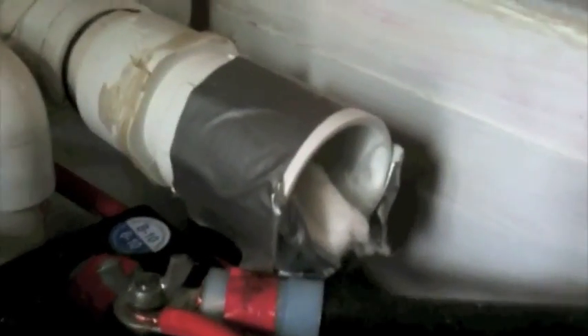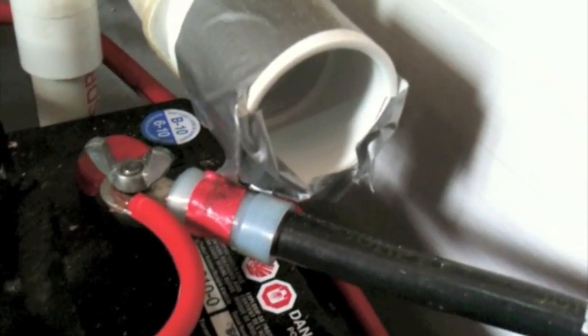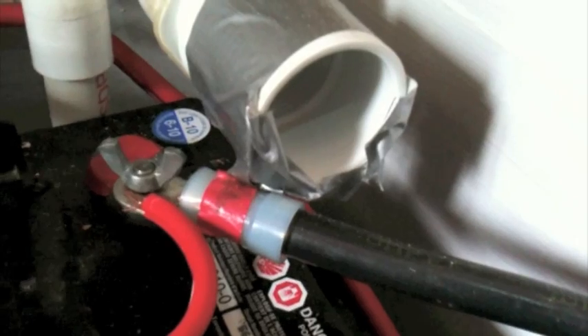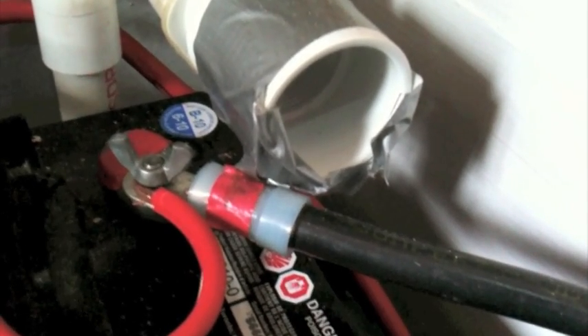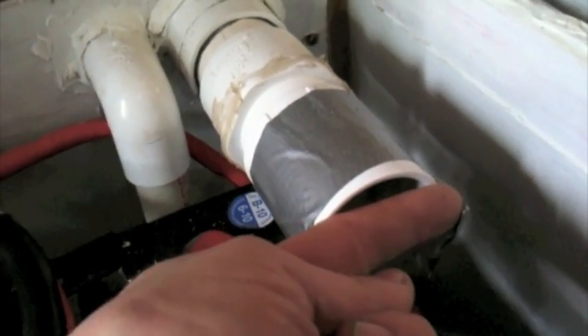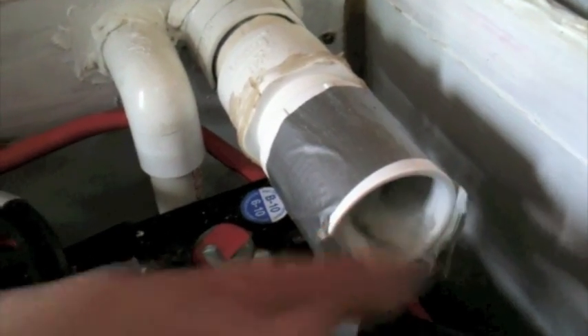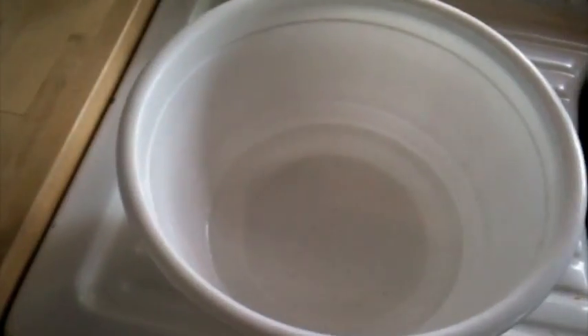There's a little bit of insulation in here. In wintertime I don't like to leave it wide open because I'm not going to be generating high amps — like 15 amps — that would create a lot of hydrogen. So I just put a little insulation in and leave just a small gap open. I just feel better about that. Today I'm going to check the water levels on my batteries.